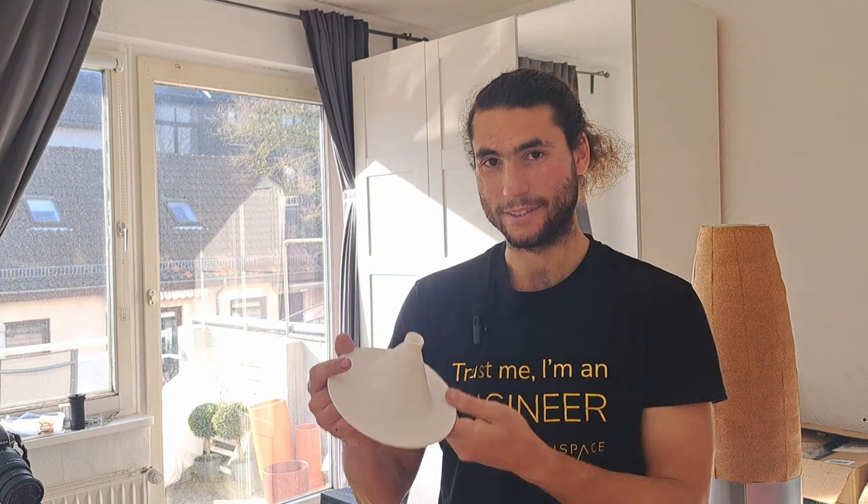The next part of our build is interfacing the funnel, which is actually going to help divert the flow from the tank to the injector. We're going to be casting the funnel for the injector. We want to do some testing with it, so this is going to be what connects our pressure washer to the injector plate. We can get a really good test of how the injector behaves by just shooting high pressure water through it. In order to make this funnel, we can't just use a 3D printed part because it probably won't survive the pressure of the pressure washer. To accommodate this, we're going to actually cast it out of aluminum.